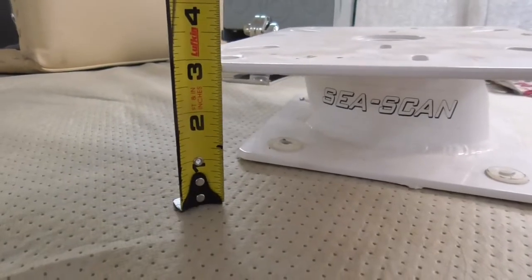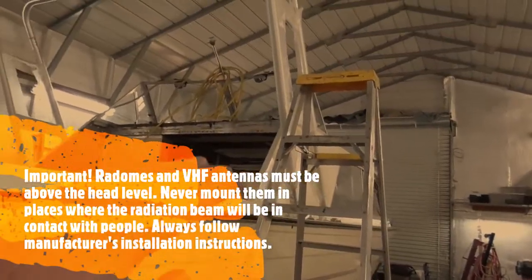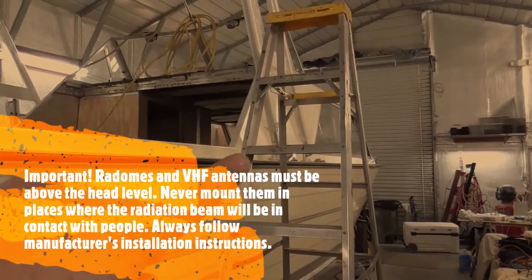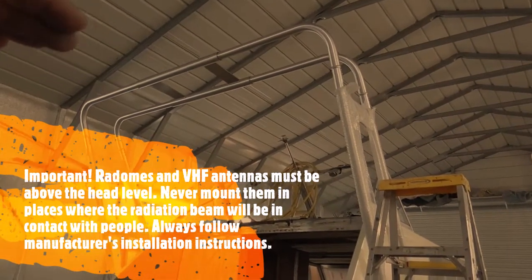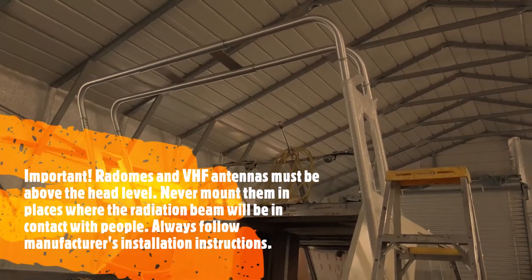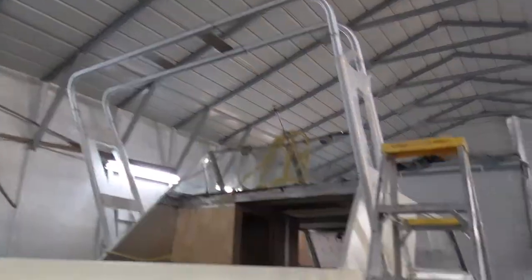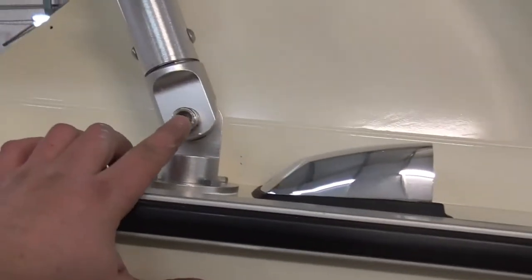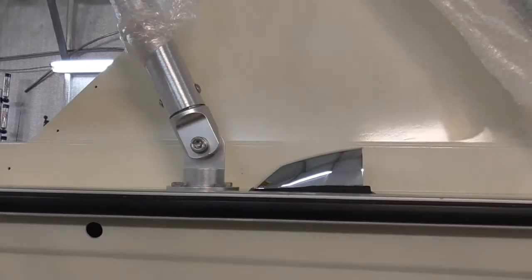Here's a radar mount off of one of our other boats. If we didn't do what we just did, we would have to use this bracket to give that angle — it's about a ten-degree angle. On the front we're at about three inches and on the rear we're at three and a half inches. By engineering that angle in, and since this is slightly adjustable at the pivot points down on the gunnel, we don't have to use that bracket. We can directly mount the radar to the pad. Every boat's a little different — we'll go down the lake and test it. If we need more angle, we simply loosen each of these four bolts and move this forward or aft a little bit.